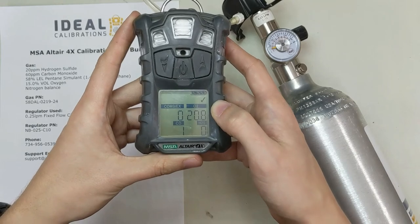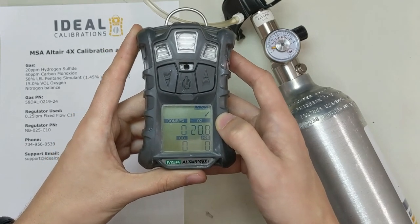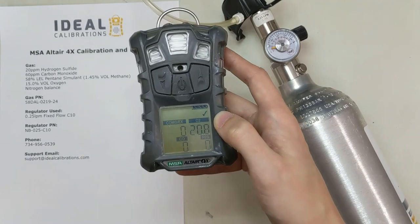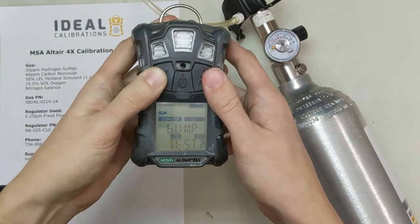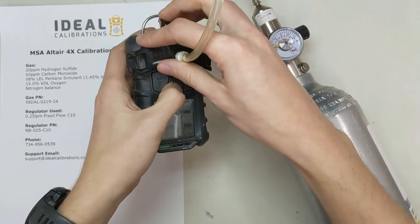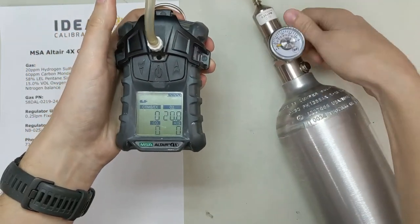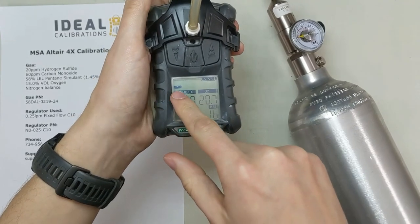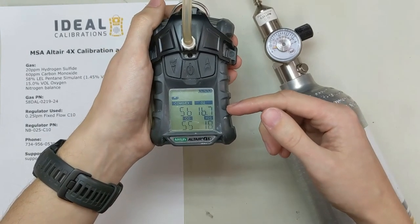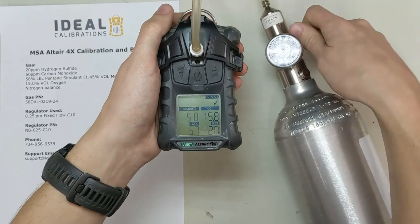So the standard zero and calibration procedure is done. Now, once you've done this, you're going to want to go through and do a bump check on the unit afterwards to make sure it's ready for the field. Normally I'd let this sit about five to ten minutes before doing a bump test. To get to the bump test menu, press the right button and it'll come up asking if you want to do a bump test — hit the middle button. Get the calibration adapter on, it's now looking for gas. We've turned the gas on, it's seeing gas now. We don't have to do this for very long — it's a quick process. Turn the gas off and we've done a bump test.